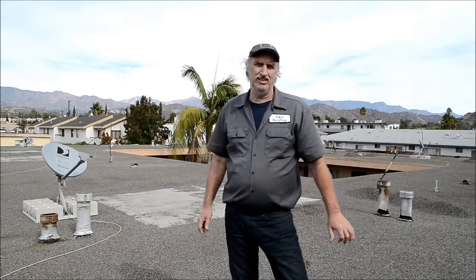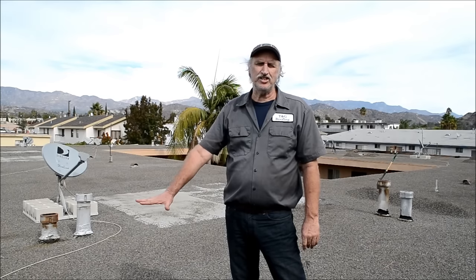The first thing we do with a gravel roof is we get rid of the gravel. A lot of people want to tear the roofs off, but it's really better not to do that because of landfill concerns and you also want to maintain your insulation. When you go over the existing roof, the real problem is weight. By getting rid of the gravel, you're getting rid of 200 pounds per square. Our system is very light — it's 40 pounds per square.